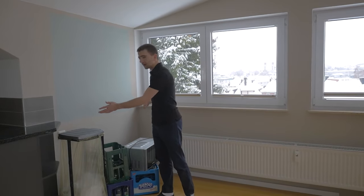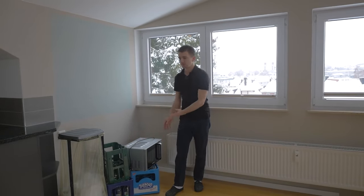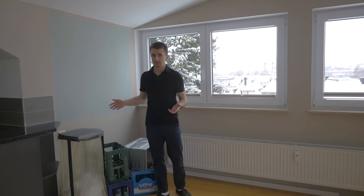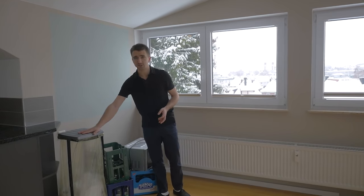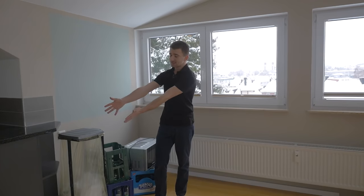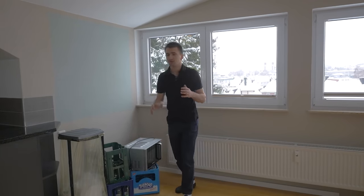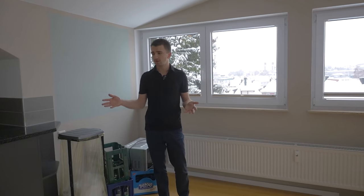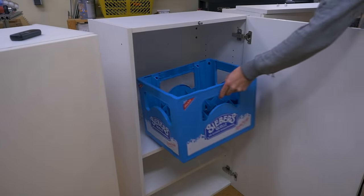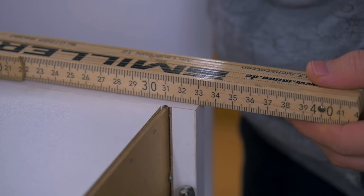This is the space in the apartment where the cabinet will be. I wanted to house a microwave, 3 beverage crates of different sizes, an additional drawer for random stuff, and a plastic trash collection thing. Where I live, plastic trash separation is a thing. Everything depends on whether the biggest crate fits in the existing cabinets, since I have to work with what I've got. Fortunately it fits, which means I can base my design around the 33cm wide side panels.